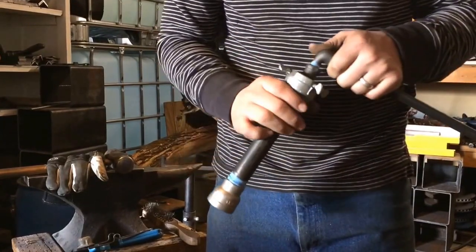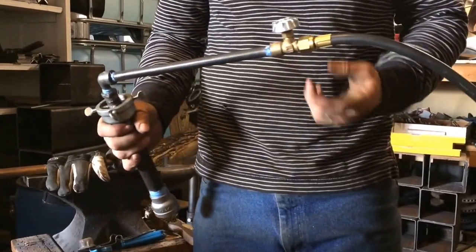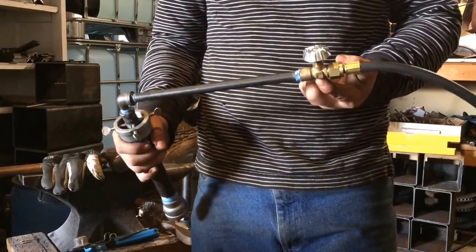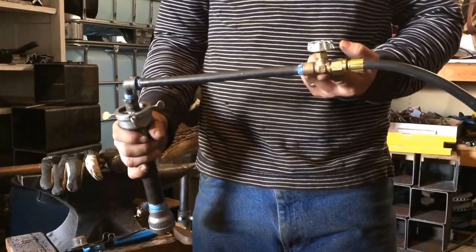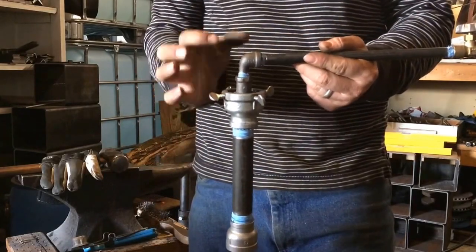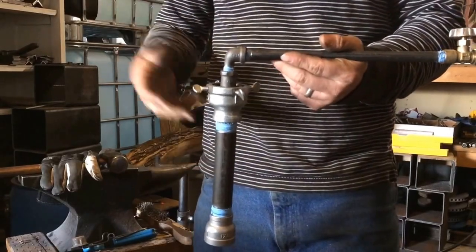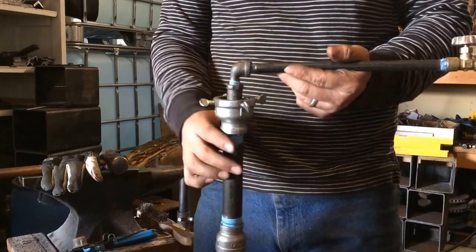You have to order those stainless couplings — I ordered mine from Ferguson. It was kind of hard to find. The flare I've only found in one place: Jim Fox sells them at thermalartdesign.com. He sells his burners as well — his cost a whole lot more than mine and function almost exactly the same. His does have a sliding choke so you can change for oxidizing, reducing, and neutral flame. But I never use the choke, even though I have some of his burners and use them all the time.